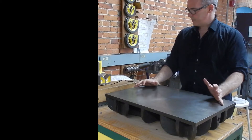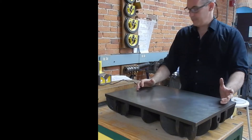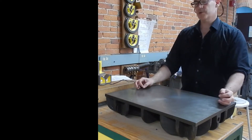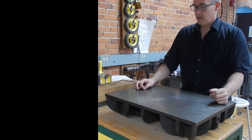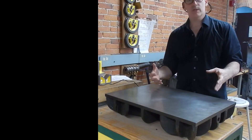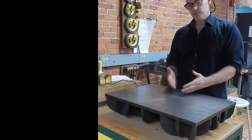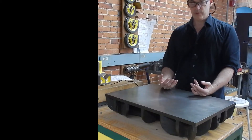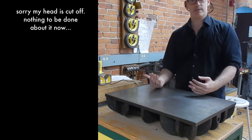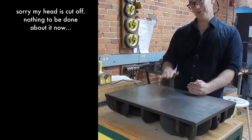The whole reason we have surface plates is to increase accuracy. You're going to have to establish for yourself how accurate you want to be. A human hair is 3 thousandths of an inch thick, and we can actually measure that. Generally in this shop we could work to a tolerance of about 6 thousandths of an inch. I work to a tolerance of about an eighth of an inch because I'm not good at measuring. You have to decide what your goal is — how accurate you need to be to suit the project. I would argue that all designers and people who make things should figure out what method of measuring suits their own personality and abilities, and also design pieces that will allow them to measure that way successfully.